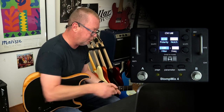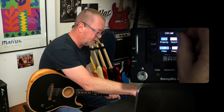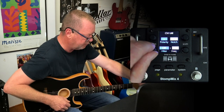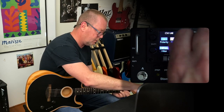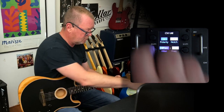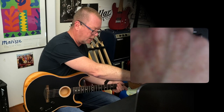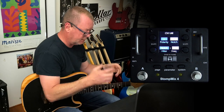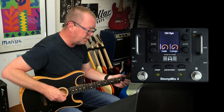You can turn on or off the notch filter and give it different degrees of level. Down here is the actual filter — at the moment there's no filter because it's off, but I can make it a high pass filter to roll off bottom end if there's too much. Or I can make it a notch filter to dial in a frequency. From there we go to the next page: channel 1 dynamics.